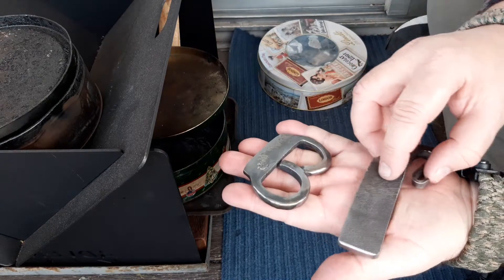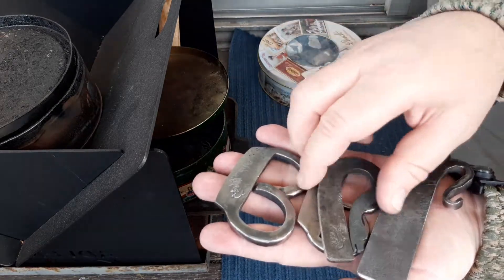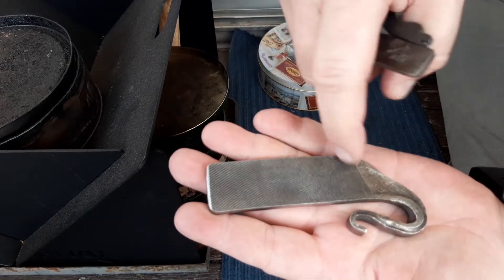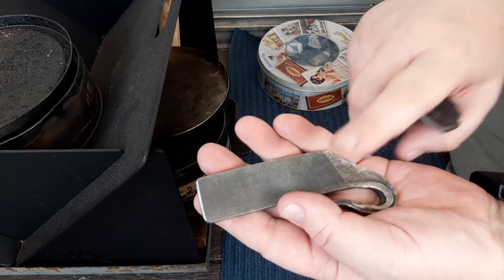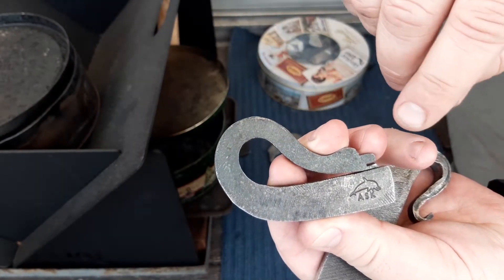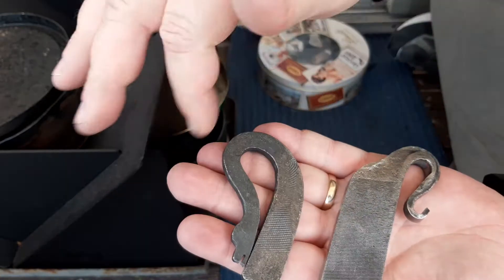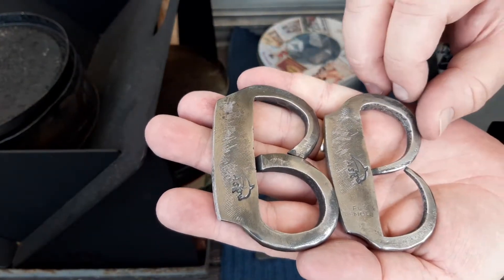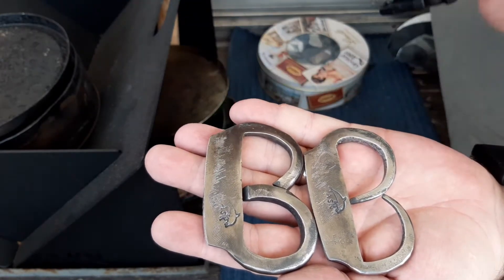I have four of them now. That's the reason why I'm shooting this again — I didn't include two that Jack made me. I've got: that's the one I made just recently, a Nicholson file, forged it and then re-hardened it. Sparks nearly as good as my Kirkham's. This one was made out of a Wilkinshire file, made by Jack — sparks incredibly well. Again, just forged into shape and then re-hardened. These are a couple of B shapes that he made. I'm not sure which types of files were used, but again, they spark really well — forged into shape and then re-hardened.